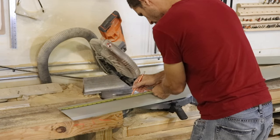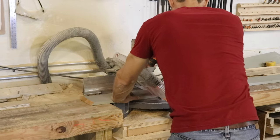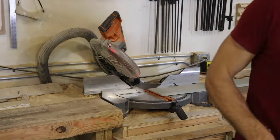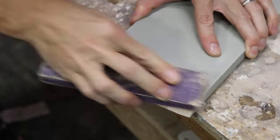Then I wanted to cut my battens. I cut these with a 45 degree bevel on either side to make sure they fit easily, they open and close easily, and to give them a little bit of styling. Make sure you sand all the rough edges from the cuts.